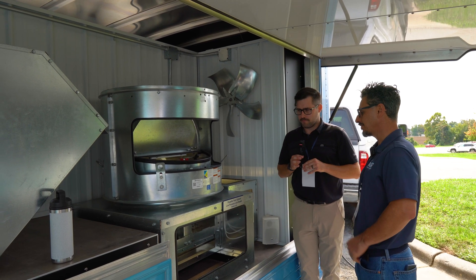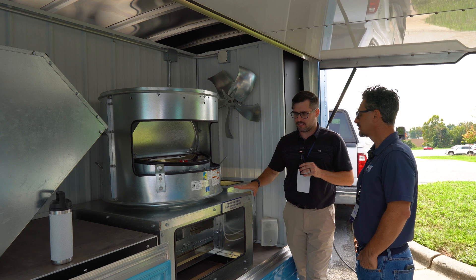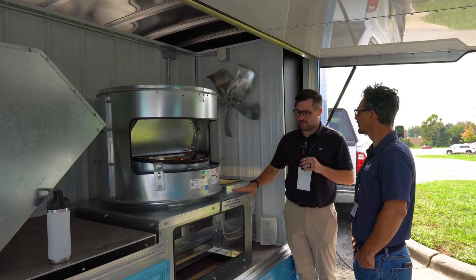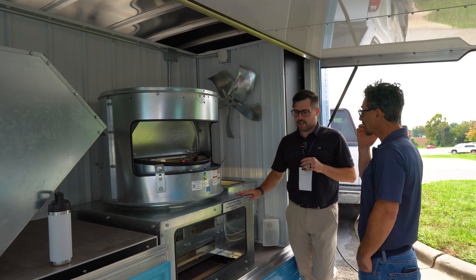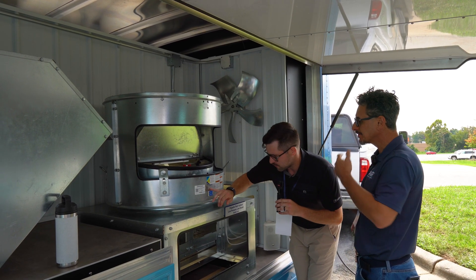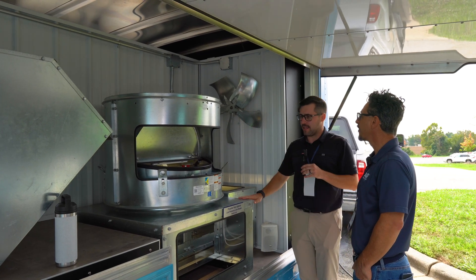So what type of applications would this be? Warehousing. This is a low static pressure, high CFM application. A lot of times these go up to 68,000 CFM at an inch of static pressure — one fan will do it. Now what is this size here? This is a size 24, so a 24-inch prop on that unit. This is what's inside down here.